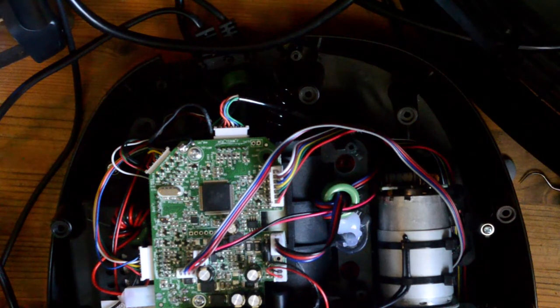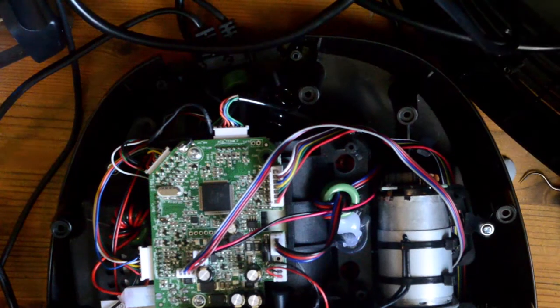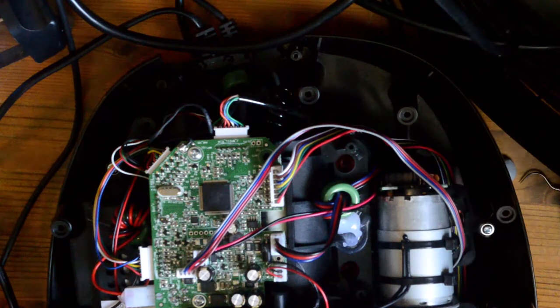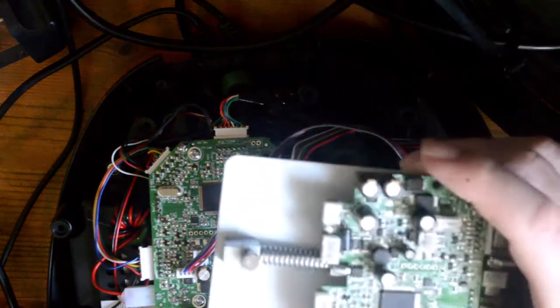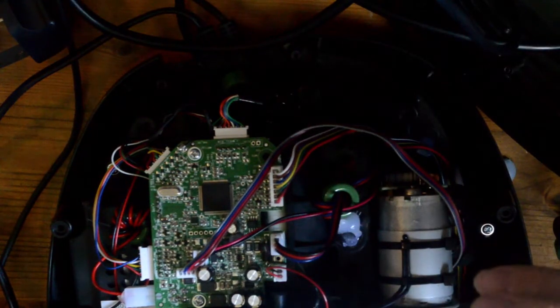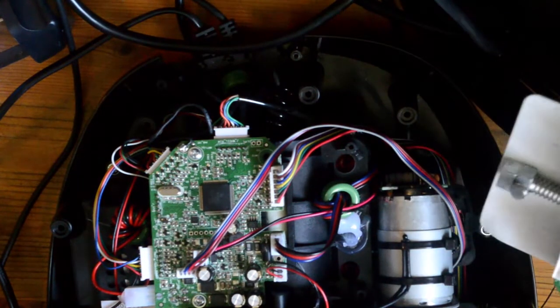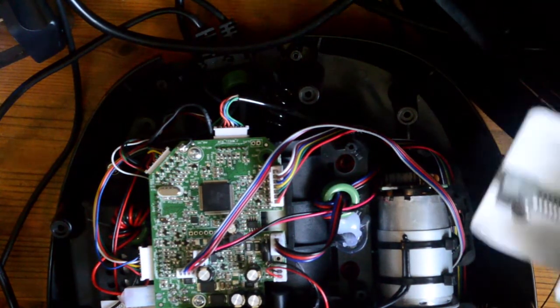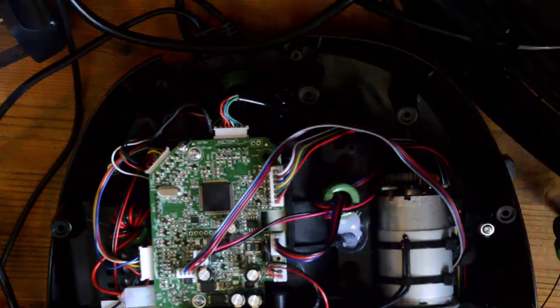This one's measuring something. There were other ones on there with the code 103 on, and they measured 799. This one I took off the board measured the same, 800. Wow. But I put that in, and I don't know whether that's good enough, but off the spare board that I took out, there are some on here. So if I have problems, I can take that optical sensor back out and replace the resistor like for like, because there are some on there.